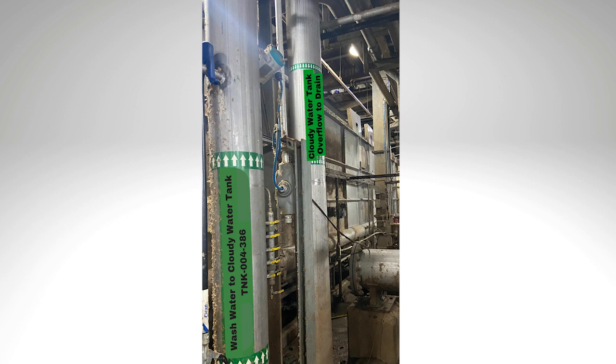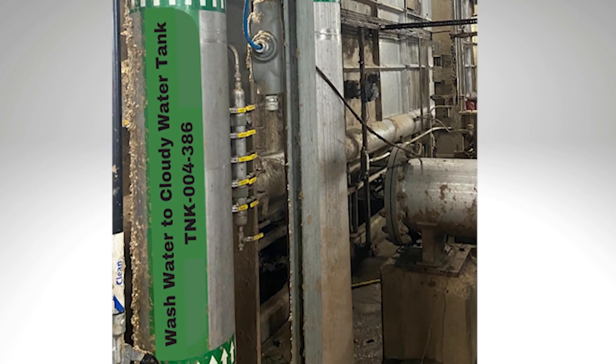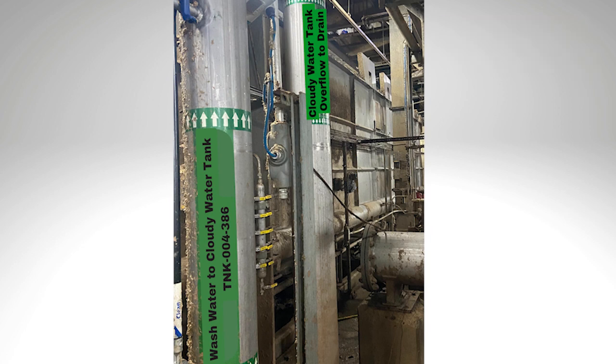For our next example we can look at piping. Labeling the flow direction is a good practice. You can also label the material in the piping and perhaps where it is going. If your piping has its own equipment numbers you'll want to include that, otherwise you may just use the equipment number for the nearest or next tank. Color coding by service is also an option that can work well with piping. If you choose to color code the entire pipeline, make sure you have a paint spec for each service and someone will need to manage that process closely.